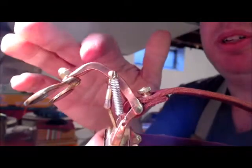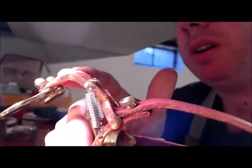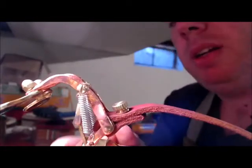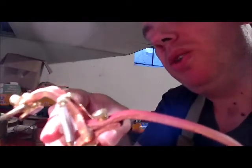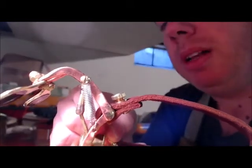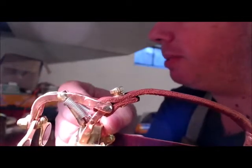There is what looks like a pneumatic tube or a hydraulic tube right here. It functions as a simulated hydraulic tube — we can't work up a whole set with hydraulic lifters at this scale. What it does accomplish is what's called an over-center lock. When it gets to this point, the piston and piston rod become out of center and will support the weight of the visor armature, which is being pulled down by the springs you can see here. You don't always want the visors down, especially if you're a doll and want to look at something without them. This over-center catch does a real nice job leaving it up, and when you're ready for it to come down, you just push it in and it snaps right back down.